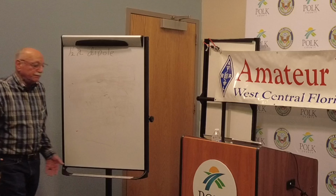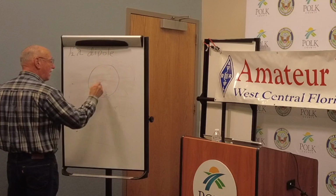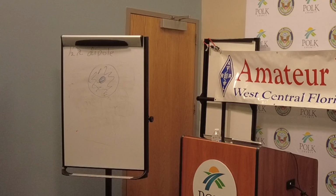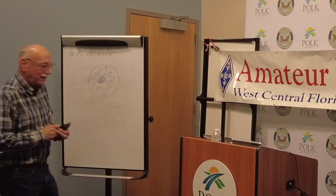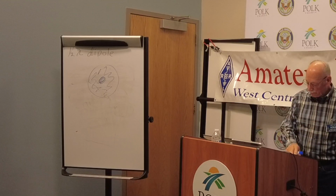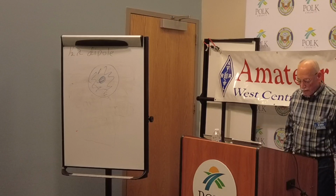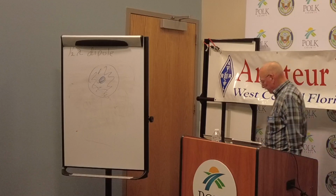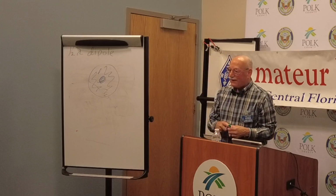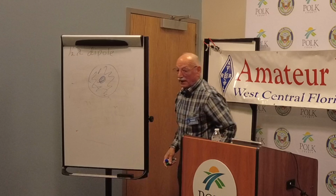But what's a coax cable constructed of? Coaxial, here, the conductor in the middle. What's this stuff in here? Some insulation, some dielectric, okay? And that affects what part of the coax in terms of radios? This may be slide 8. Another type of insulation affects power handling, but it also does affect loss. Affects loss, it affects power handling, and what else does it affect? Velocity of propagation. Oh, yeah.